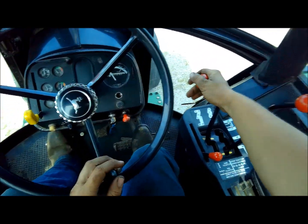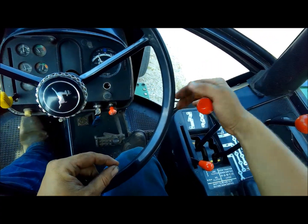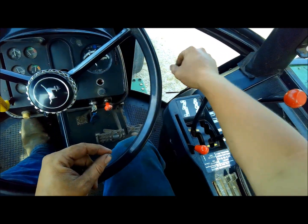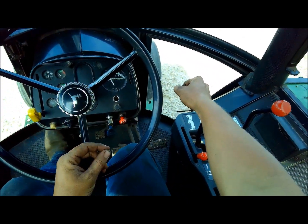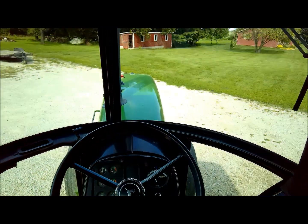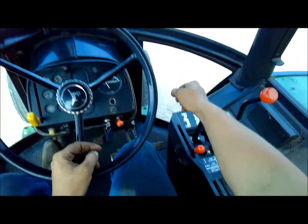You get down here, and if I've got the clutch in for a little while, it'll go into whatever you want it to do. I mean, it'll go through any of the gears, but then it's when you let the clutch out. One time I had it when it was down in the A range, it held on so long, it got the whole tractor up to speed before it finally dropped into number 2.